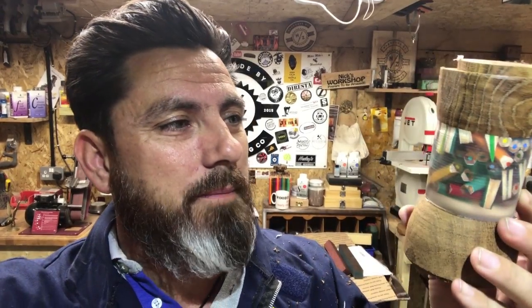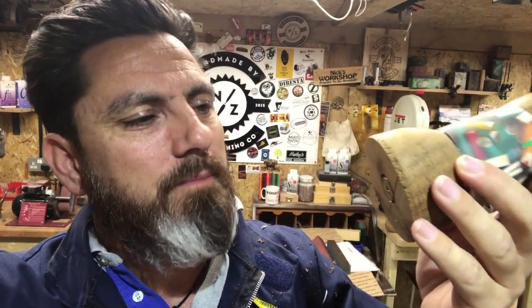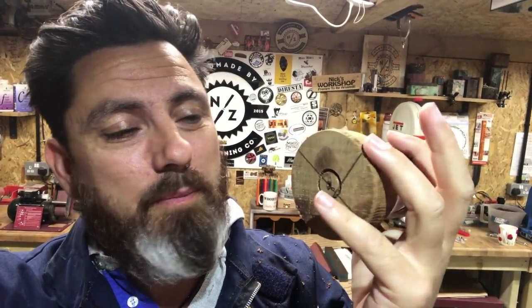So that's as I see it so far. This is just half of the pot because it needs to be a little bit taller than normal - that's kind of what Keaton has requested. We're going to finish the bottom now. I'm going to mount this back up in the lathe because I've made a tenon up here, and that's going to allow me to finish the bottom. Then we can reverse chuck it and hollow out the middle.